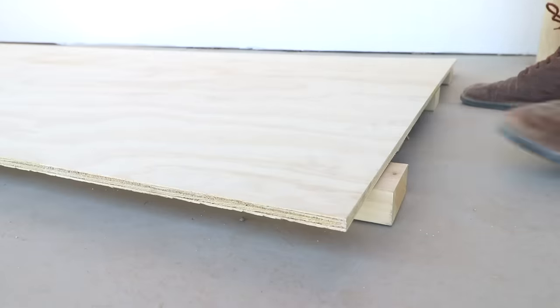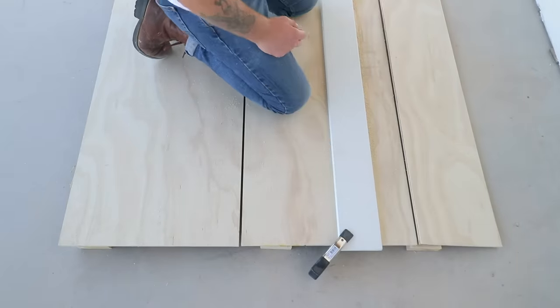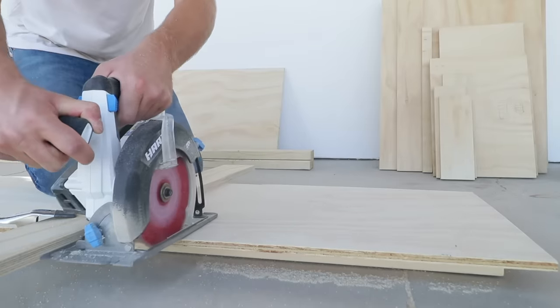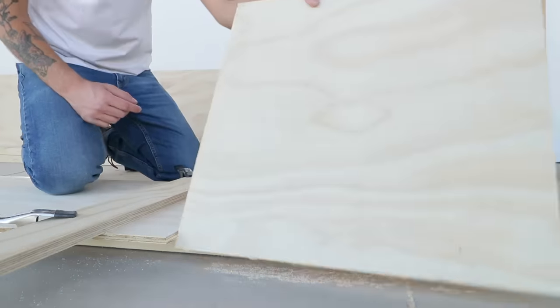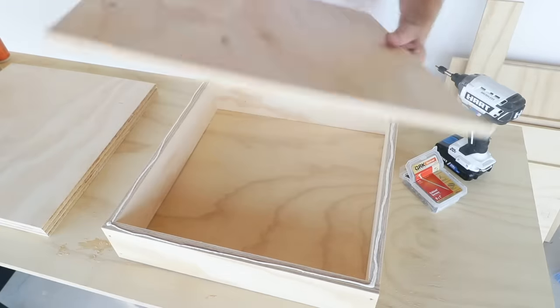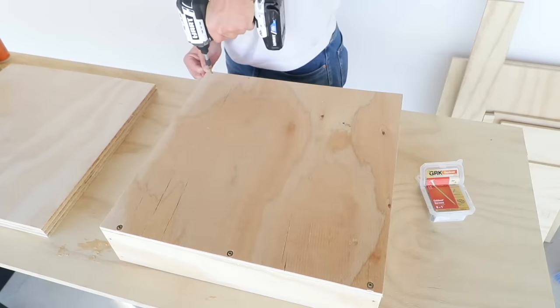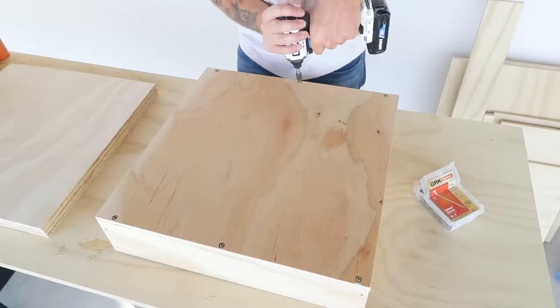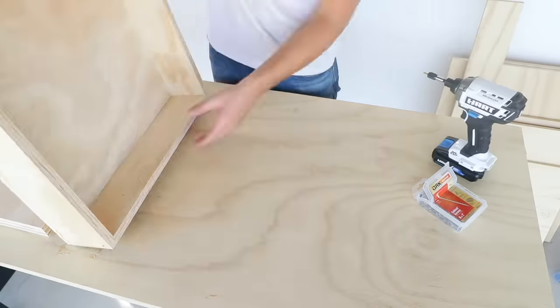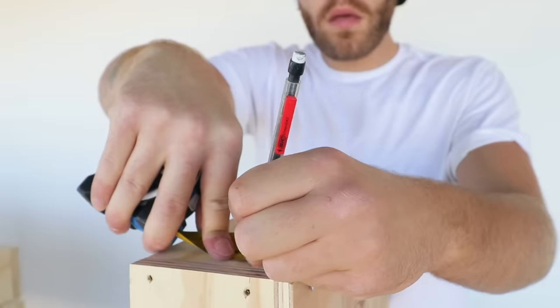I got a sheet of half inch plywood for the bottoms of the drawer boxes — I went a bit overkill using three-quarter inch plywood left over from the cabinets, but I thought I might as well make good use of it. Being careful to cut the pieces square meant I could use them to ensure my cabinets were as square as possible, and then I could install my drawer slides.